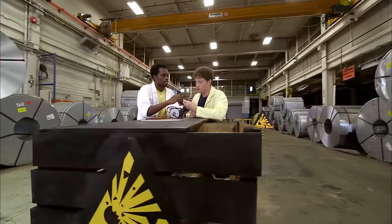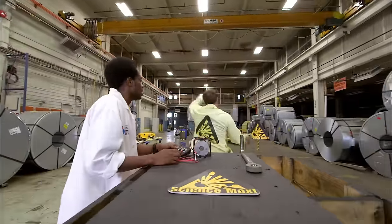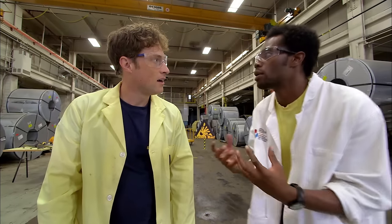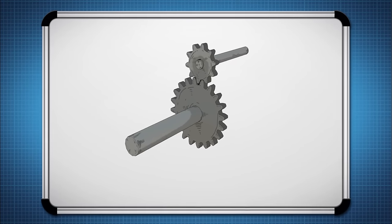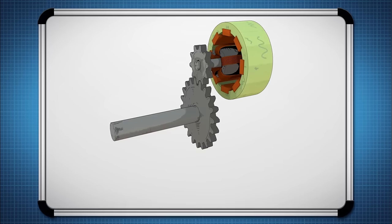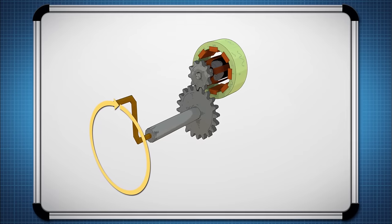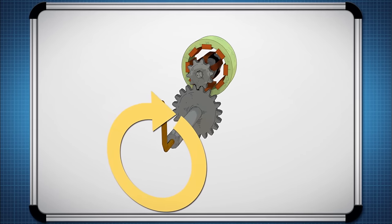Anthony and I are trying to generate electricity using human power. Spinning the generator didn't work too well. But we found if we used some gears, like those on a bike, it worked better. Using gears is a great way to get work done. The good news is there are generators with gears already in them. That means if we can turn the spindle once, the gears inside will spin the coil a lot of times. The only downside, turning the spindle gets harder the higher the gear.